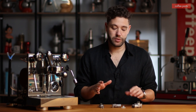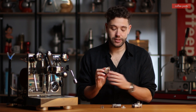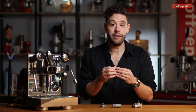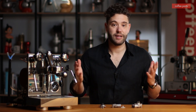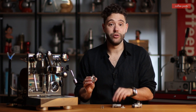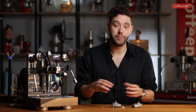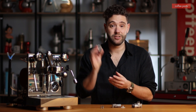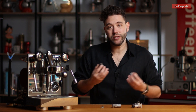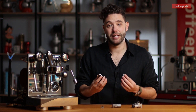Sometimes the readers here stop reading the magnets and you need to replace the head. Sometimes the impellers start playing up — they're plastic, they go brittle, they age — and then sometimes you just have to replace the whole unit. There are seals around here that seal the unit. If you're having a leak from the top, it's a seal. If it's not registering, it's typically the top, sometimes the impeller. Because they age at the same pace, a lot of times people just replace the whole unit.